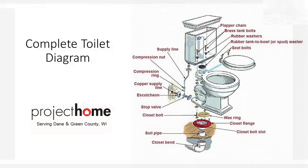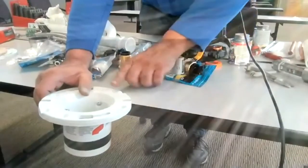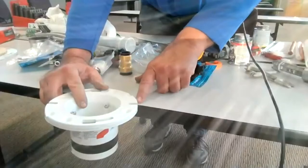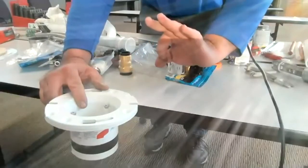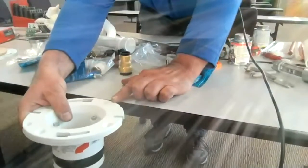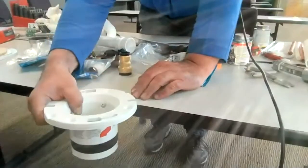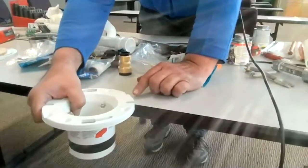A complete toilet diagram. If you fix your toilet or need a new toilet, I want to highly stress where your floor is and where the closet collar is. Let's say this is your main floor in your bathroom — if you see your toilet flange like this above the floor, you're fine. But if you take your toilet up and now it's flush with the floor, you have a problem. The flange is supposed to be above the floor.